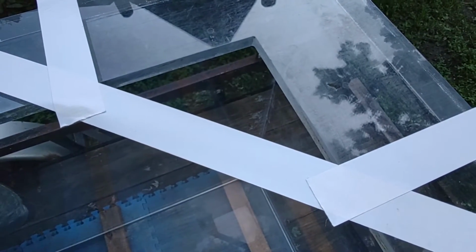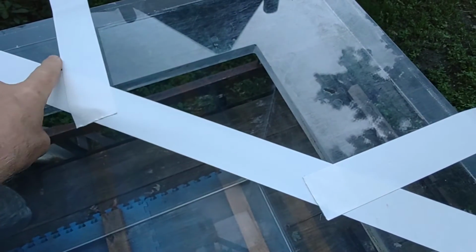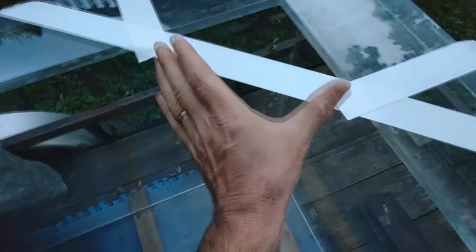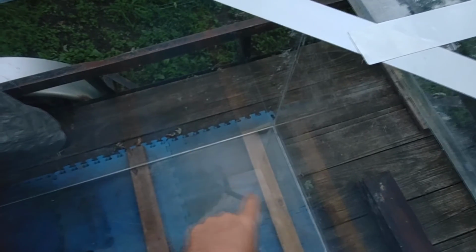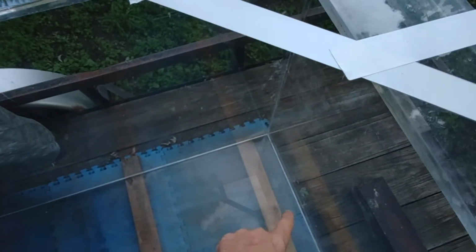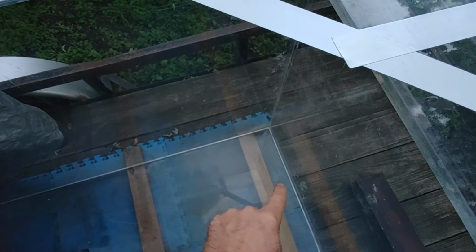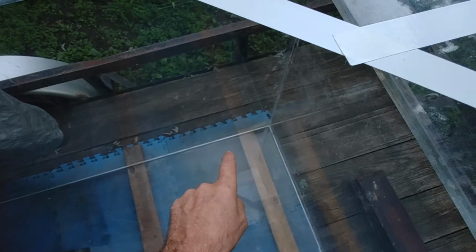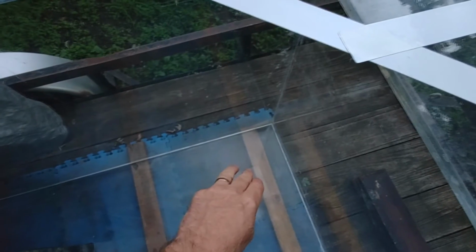This is a big factor right here in being able to hook up the Beananimal system for your main siphon, and then obviously an emergency backup. And then obviously you're going to have a pair of return lines. So you're going to have some pipe work down inside here. And obviously this is going to transfer all the way through right to the bottom. So I've got to factor in multiple holes in the bottom for the bulkheads. Not only do I have to design this here at the top, I almost need to transfer this through and visually draw it out down here in the bottom, knowing that I'm going to have enough room for probably a 1-inch return line there, so you've got 2 bulkheads there, and then more than likely 3 1.5-inch holes, 3 separate bulkheads for the water coming down. One's going to be the emergency backup, and then probably 2 for the primary.